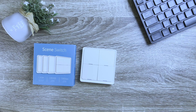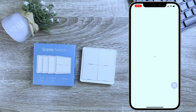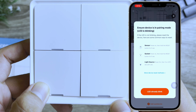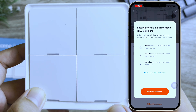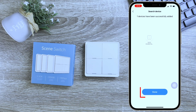To set up this device, just like other Zigbee-based products I've unboxed on this channel, we do need a hub or a gateway. Open the Smart Life app on your phone, look for the hub, and click on it. Click the add sub-device button to pair this device. Press and hold button 1 for 10 seconds until the light blinks rapidly, then click. Once the LED blinks and the device is detected, click.